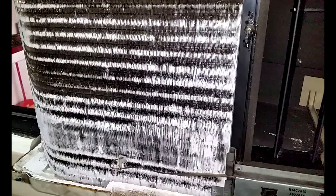Those are the things you need to check initially. If all of those checks fail, you need to take it to a technician because the reason may be a lack of refrigerant. You need to refill the refrigerant, but first find and fix the leak properly — don't just refill without fixing the leak like I did. I did that because it's an old air conditioner and the technician couldn't find the leak, but in your case you should find and fix the leak first.